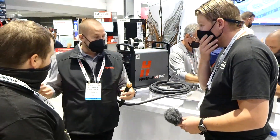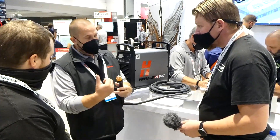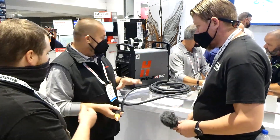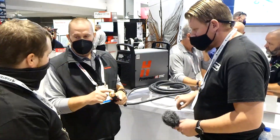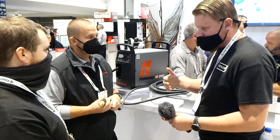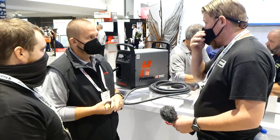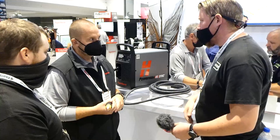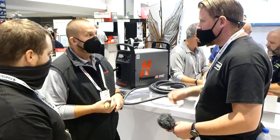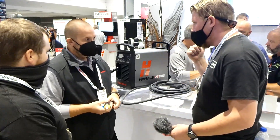So if you've got a bunch of 65s to 105s and you want to make the change to the single-piece, buy an adapter, throw that on, and now you can use it — you just won't have the smart features or the data to go along with it. And if you're a fabrication company that bought a new 85 Sync but has a wall full of hundreds or thousands of consumables, say your unit died — you can still use them, you don't have to throw them out.